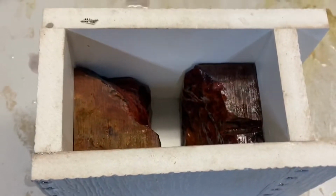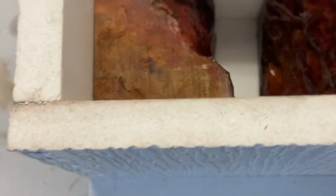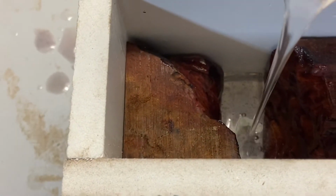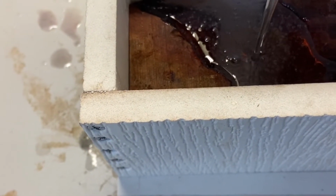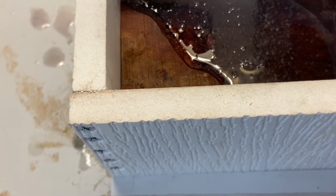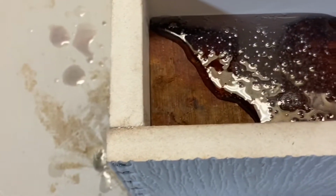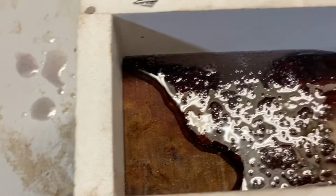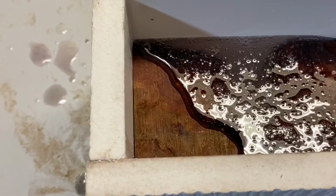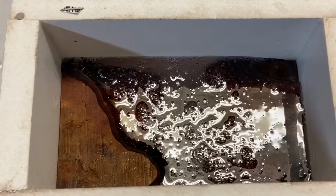Silicone in the pieces of wood. So what I'm going to do now is just pour it in and then we'll heat it up, get the bubbles out, and that'll be it. All right, here we go. Not too bad of a guess. I'm going to give that a second to set. Let it all seep down to the areas where I either don't want it or it shouldn't be, but you know, it's liquid, so it's gonna go where it wants to go. And then I will hit it with a heat gun. Get all them bubbles popped. Get her nice and clear.